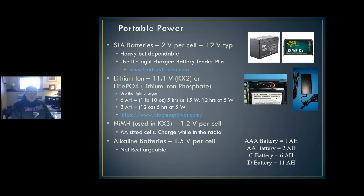Briefly, let's talk about power. I used to have sealed lead acid batteries — two volts per cell, 12 volts typically. They're very heavy, and they're not really in vogue anymore. The problem with these batteries is I bought one from Radio Shack recently and it must have been sitting in the warehouse a long time because it came to me under 10 volts. Once they go under 10 volts, their lifetime is limited. If you have a good one, just get the right charger — these are tri-mode chargers that dump a lot of current when the battery is low, ease up until fully charged, then trickle a float charge. Battery Tender is one of those brands.